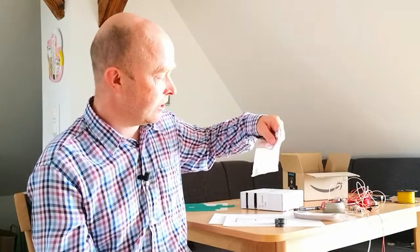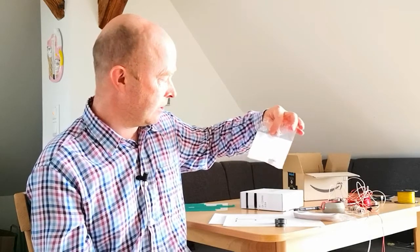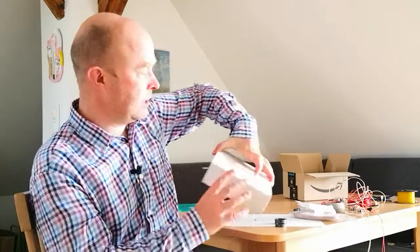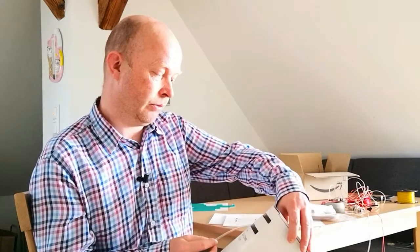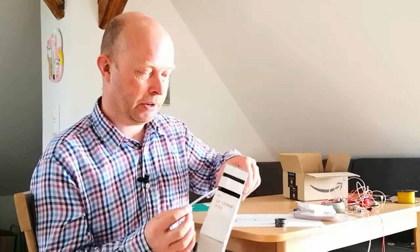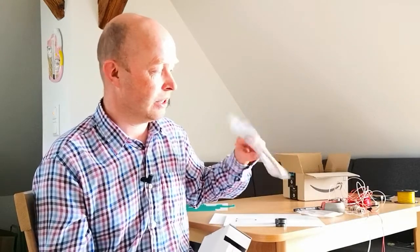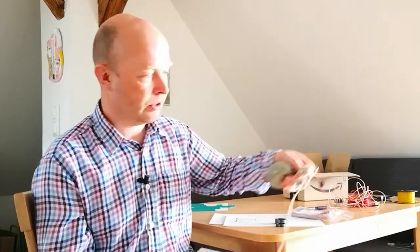And then you'll need a connector. I've got a nice Telegartner BNC there that's going to go on the end. You'll also need, you might have seen it on the ferrites, some clear transparent heat shrink tubing. Well, it doesn't have to be transparent, but you'll need a long piece of it. And I've got some 2.4 to 1.2 millimeter transparent tubing there. This is because, as I say, this coax is so delicate. It really needs protecting, especially around the ferrites.